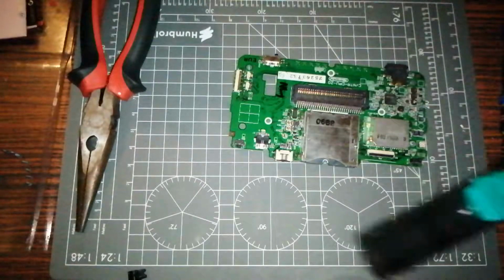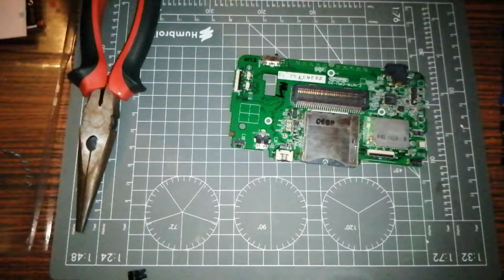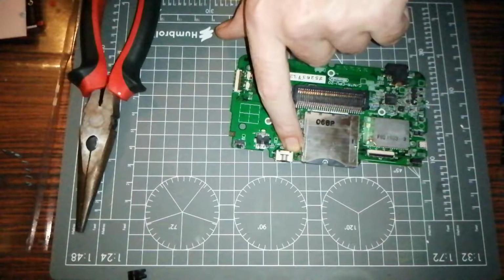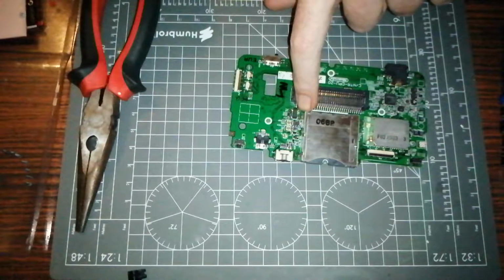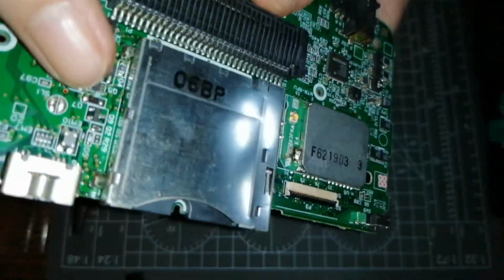Right, solder sucker ready. Check. Soldering iron. Turn it up a little bit heat-wise. So we're going to run 350 at the moment. We're going to go 360-ish. It's a really crappy little dial, so I'm kind of just winging it. Alright, so plan of action. We're going to suck as much as we can off that, solder wise. In fact, what I'll do, I'll show you.